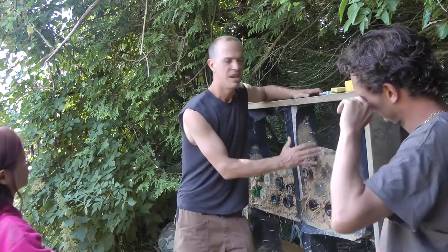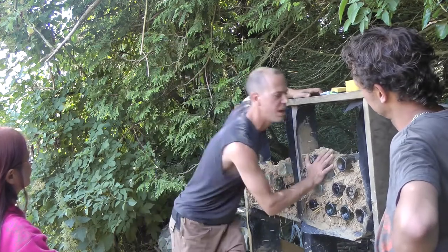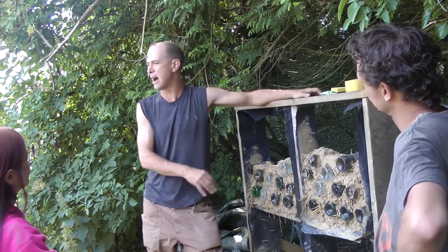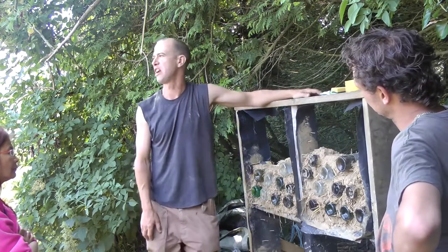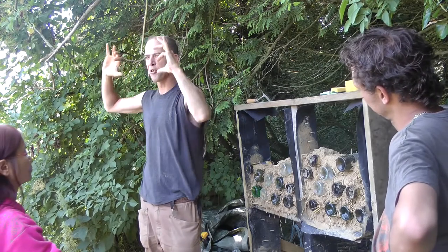And if you imagine it's a big square in an aperture, if I didn't do the porcupining, I'd be able to push that out of there. It could possibly come out. So the porcupining of these nails simply means that once it goes hard, you can't push it out. It's keyed in and locked in by the mortar around those nails on the edges.